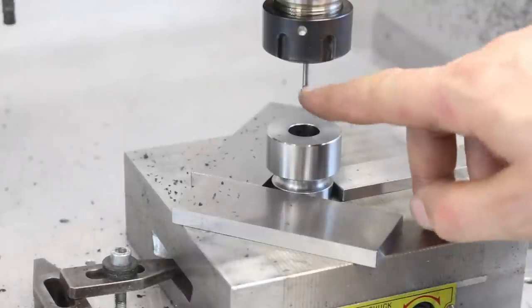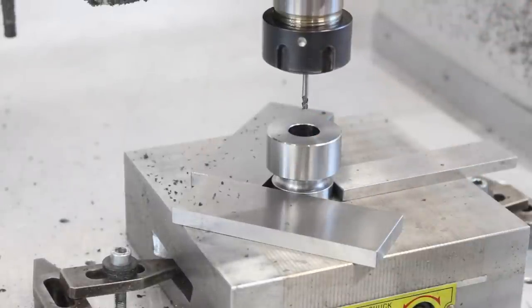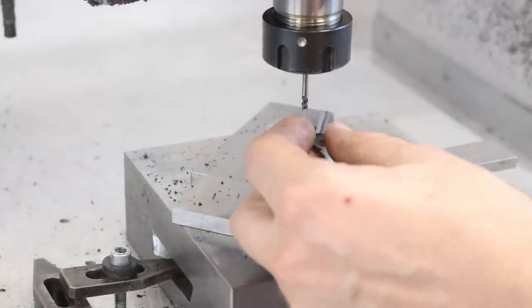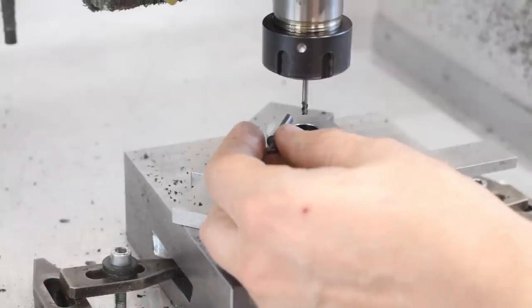Back at the mill with the necked down end mill. Now we need to touch off Z height. I like to use something round like a carbide shank. This is just a 6 millimeter carbide blank ground into a D bit, but it doesn't matter. Any end mill shank will work. And the way I like to do it,